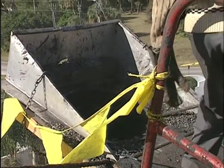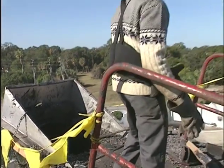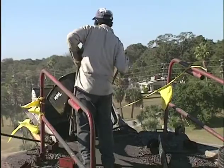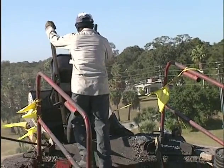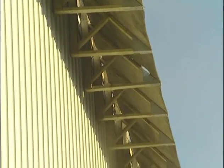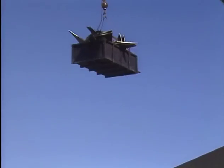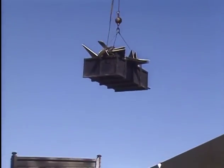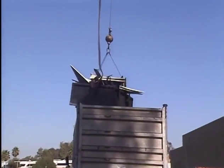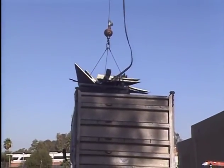They need a solid support system including heavy counterweights. Again, there are a variety of disposal chute designs, and you will receive training on setting up the type your company uses. There are also many ways to set up open disposal slide chutes if the job conditions allow. Steel debris tubs and heavy-duty tarps are also used to collect and hoist away debris. Carefully check their condition before use.